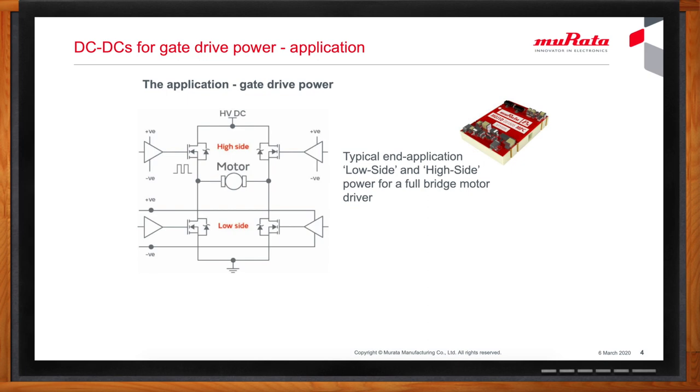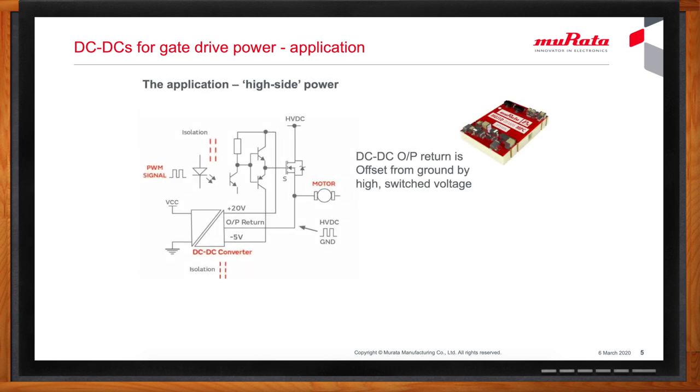There could be all kinds of transients going on here, and these devices operate where high voltages are present. Looking in more detail at a high-side switch, the PWM signal is isolated typically through an optocoupler, and the power rails for the driver are isolated through a DC to DC converter. This allows the zero-volt return of the DC to DC converter output to float and be connected to the source of the MOSFET. If you connect an oscilloscope from the DC to DC converter input return to the output return, you will see a continuous pulse waveform with an amplitude of the high-voltage power rail. The DC to DC becomes the right solution when the power rail is hundreds of volts or higher.